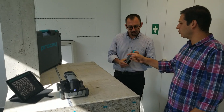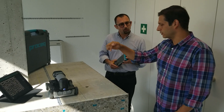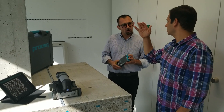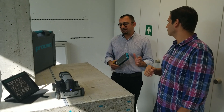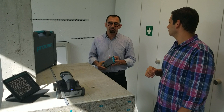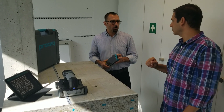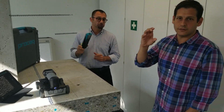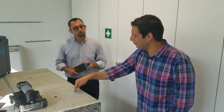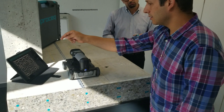So the accuracy for depth with the GPR to find a rebar — plus or minus what do you think? On the safe side, I would claim something like plus or minus 5 mm. And for this profoscope? Plus or minus one. So this is a more accurate tool to find cover to the top layer of rebar. So now we have 23 mm.